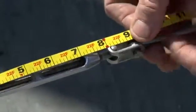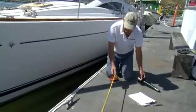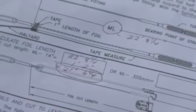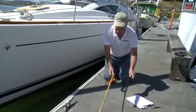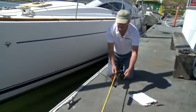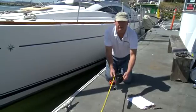From that ML dimension we deduct for the torque tube and drum at the bottom to get our cut length of the foils. We deduct 14 inches from the ML dimension for the cut length of the foils. The reason is that the foil is attached to the top of the torque tube and drum, and that 14 inches is what needs to be cut off in order to have the correct length for the foils.